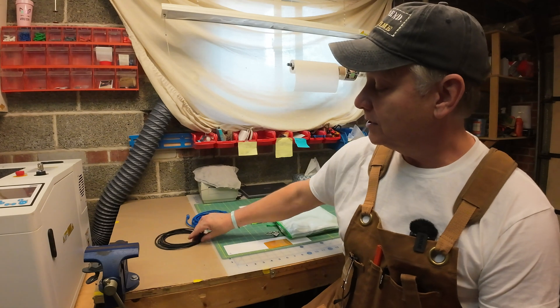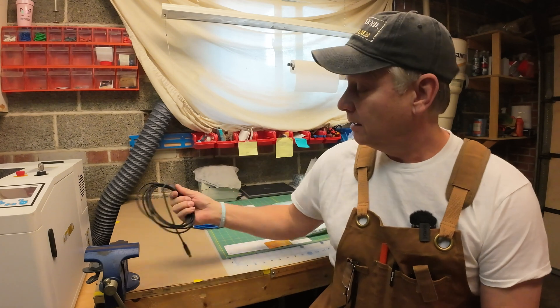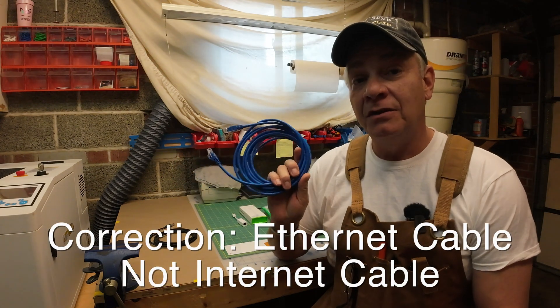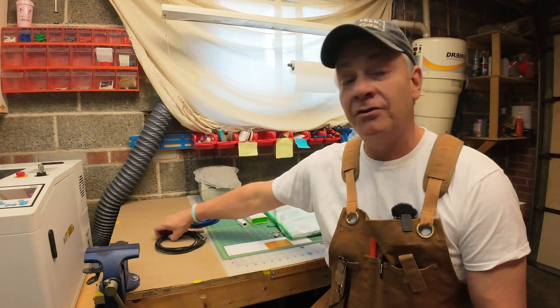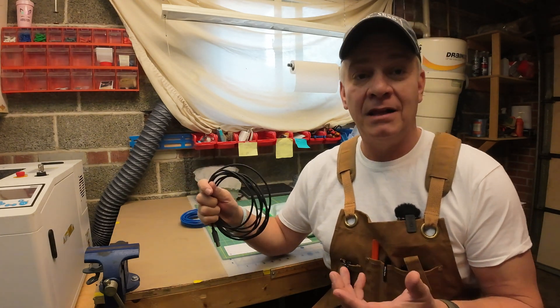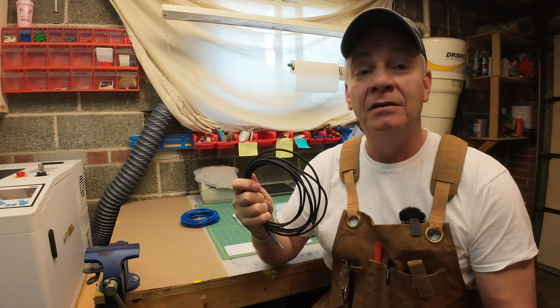You also received a black USB printer cable with your Bolt. We're not going to need that today because I won't be connecting the camera yet. If you've been watching the YouTube videos from Thunder Laser USA, you'll note that they highly caution against using that printer cable to establish communication to your Mac and Lightburn. They strongly recommend communicating through the Ethernet cable, and they reference those same cautions in their knowledge base. That's why we're connecting with Ethernet. We will need the USB cable when it's time to connect and operate the camera — we'll do that in another video.